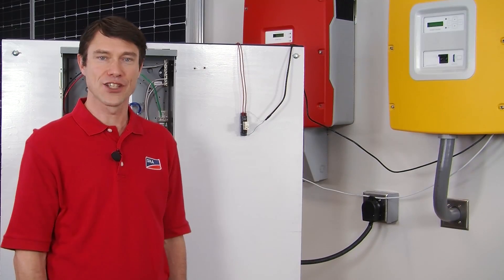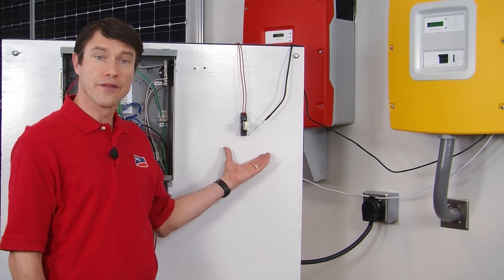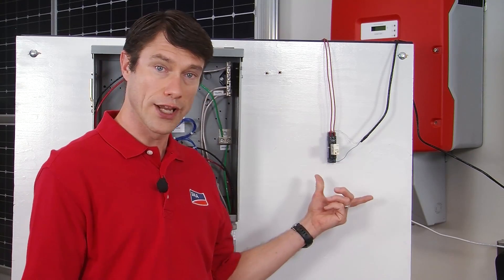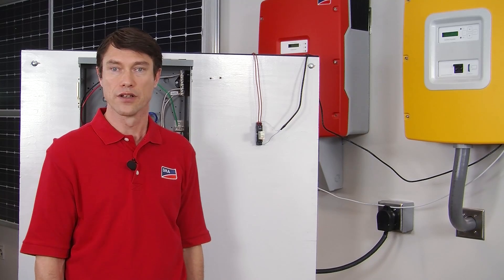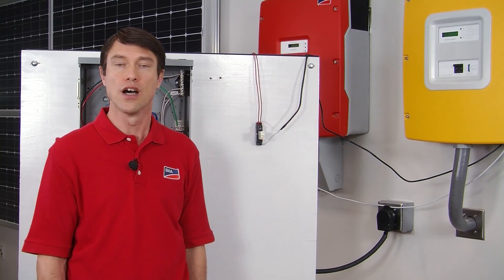With the plug wired up correctly and inserted, we're ready to replace the lid and power up the inverter. We've now wired an external relay to the Sunny Island's DIGIN input. The correct wiring for the relay you choose will be outlined in the installation manual of that relay, but what we have is grid power coming to a 120-volt AC powered coil for this relay. When the relay wiring is correctly configured and the grid is present, the relay should be open and there should be no voltage on the DIGIN inputs — verified visually on the display by a checkmark icon next to the power pole. When the grid fails, the relay will close and battery voltage will be present on the DIGIN terminals, and the Sunny Island will be aware that a generator is available — verified by an X next to the power pole icon on the display.